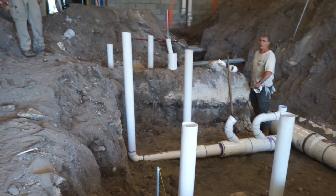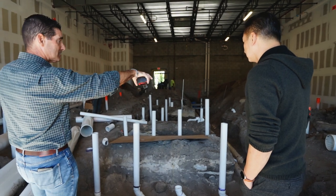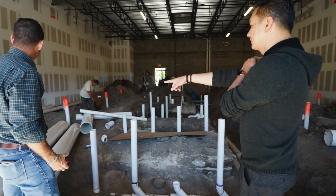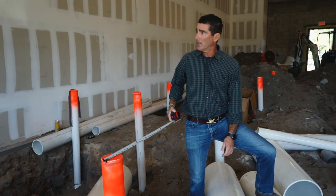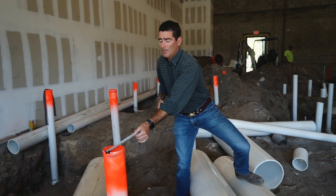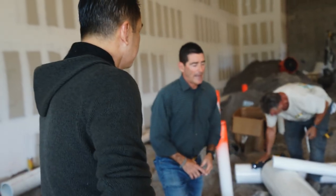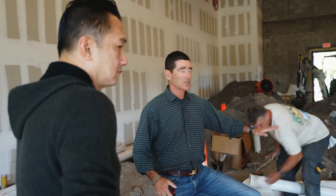We're about four feet deep, and the plumbing will run just above that — at about three feet deep at its shallowest point, going back to the deepest point, which they're working on right now as well. Pretty much next to all the exhaust for the pedicure, this four-inch exhaust goes directly underneath the bowl of the pedicure station. Right behind it will be the three-inch sewer for the actual draining of the bowl, and back here will be the electric and the water supply to the chair. We do the layout in about a day, but it takes about 21 days to complete the exhaust underground.